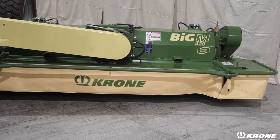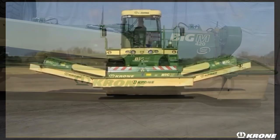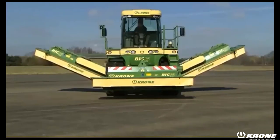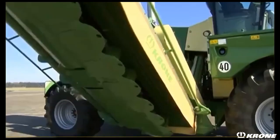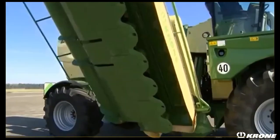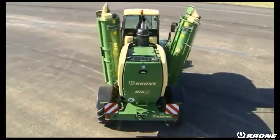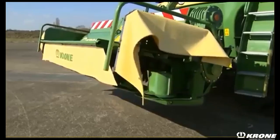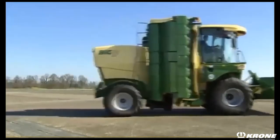The power for the wings is transferred via belt out to the mowers. The wing mowers are folded and unfolded hydraulically from the cab, so the machine is wide in the field and narrow on the roads — less than 10 feet in transport width for operation on the narrowest of roads. Another benefit of narrow transport is the ability to get through narrow gates.